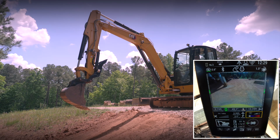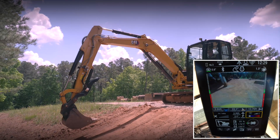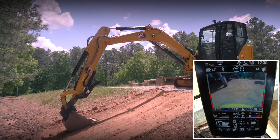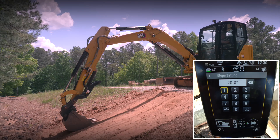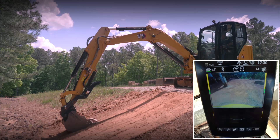Now I want to continue to pull a 20-degree slope. I've already measured it and started it, so I'm going to dial in 20 degrees via the shortcut. I'm putting it in as a negative because I want it to come from the bottom of the ditch up towards the machine — so now you can see it says minus 20.